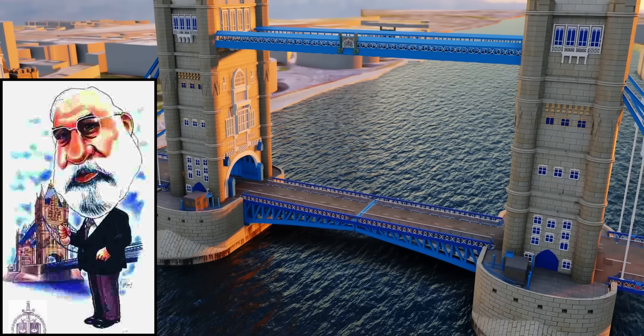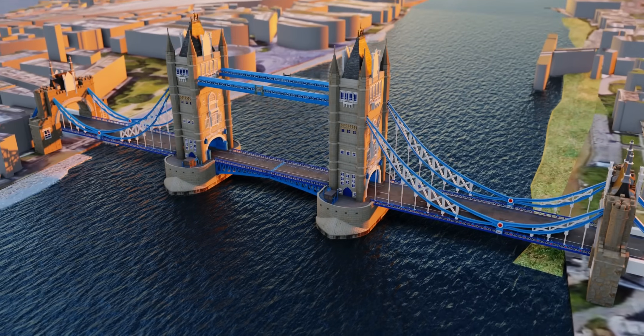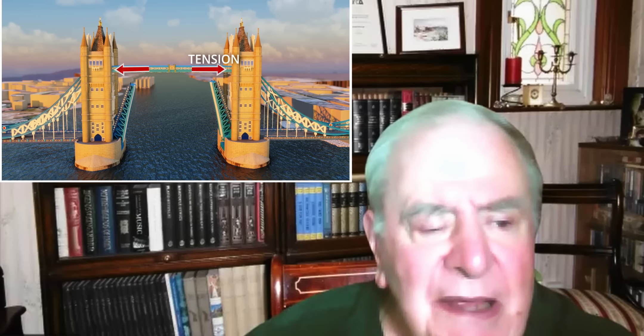I had a chance to interview Professor Jeffrey Hardwell, who has been associated with the Tower Bridge since 1974. Professor Hardwell, could you explain to viewers why the high-level walkways of the Tower Bridge are important? The walkway actually contributes to the structure. So when the bridge is down, it's a conventional cantilever bridge. But when it's actually up, it becomes a suspension structure — the towers are held up by the tension in the walkway, and then it's anchored on either side.